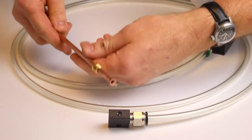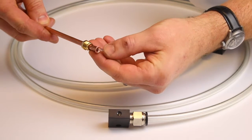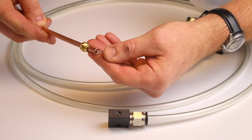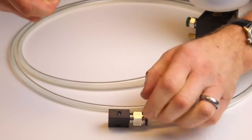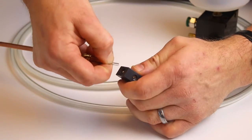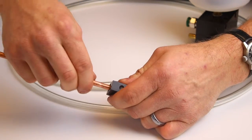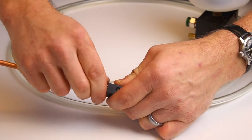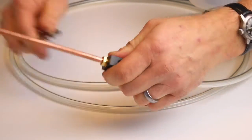To install a new nozzle onto the capillary splicer, trim the capillary from the nozzle approximately a quarter to three-eighths of an inch away from the end of the nozzle. Then grab the capillary from the nozzle either with your fingers or needle nose pliers and reinsert onto the capillary splicer. Then re-tighten the nut on the nozzle into the nozzle coupler block.